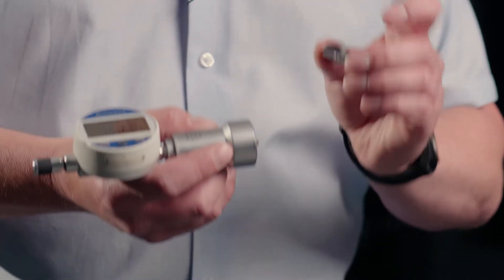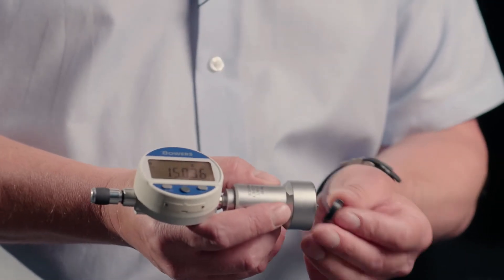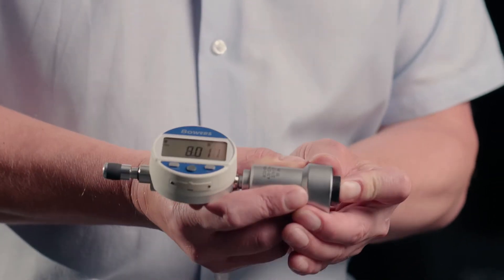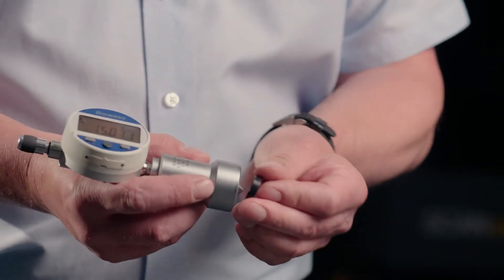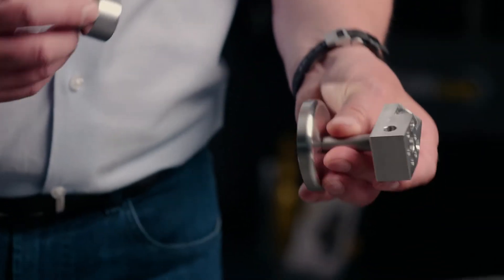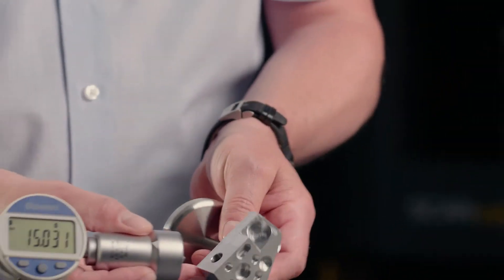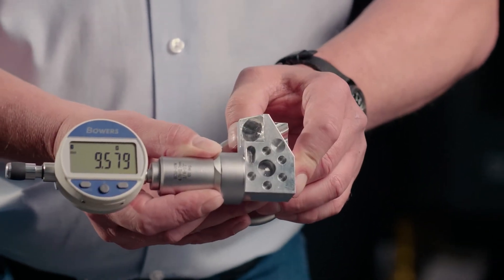So how do I set that? I'm just going to dial in the preset value into my indicator, hold that in location there, hit the set button and we're set. So now I'm just gauging that outside diameter, and if we take that to a more conventional looking application — here's a bore with a countersink in there — I put that in and I can read directly the countersink from anywhere in that particular gauge's range.